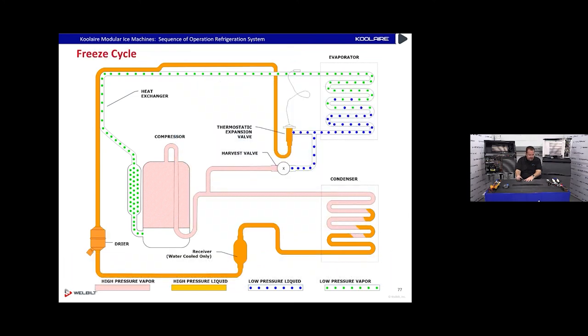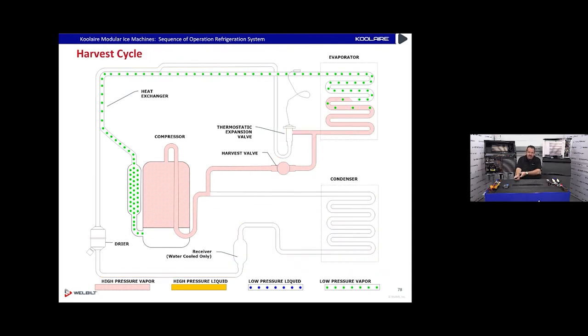A vacuum pump isn't just there to pull refrigerant into the system — it's there to get moisture out of those refrigerant lines. Moisture is bad for refrigerant. The vac pump boils moisture out of the refrigerant lines by pulling into a deep vacuum. A 15-year technician thought the only reason for a vac pump was so refrigerant could be pulled into the system — an important concept to understand correctly.